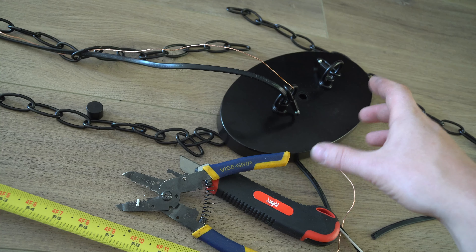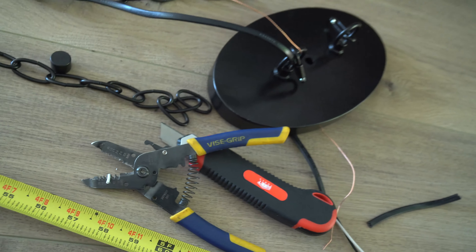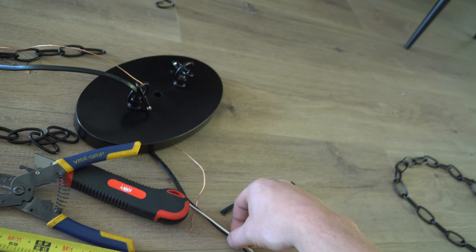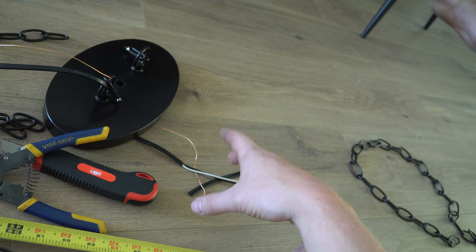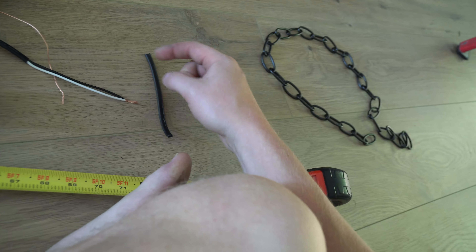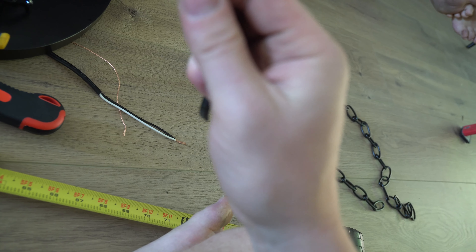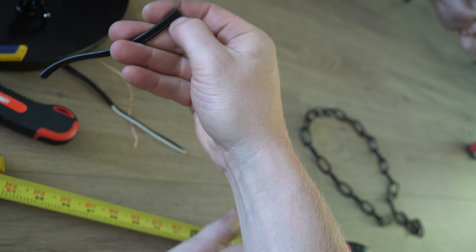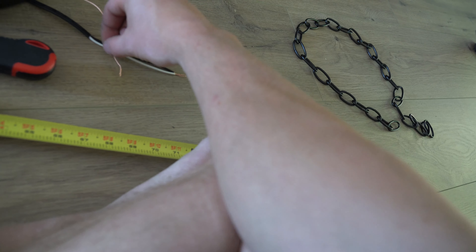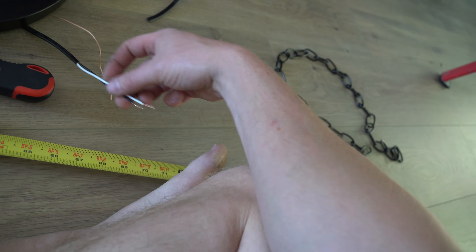Make sure you get both sides the same length. After you do that, you've bent out the piece like so, unhooked it, and left it off to the side. Do that to both sides and leave it open. Next thing you're going to do is keep pulling the excess wire to a point where you know you'll never go any lower than this, then cut that extra wire by running a knife. Don't run it around — slit it down the center. Get it started, then run an exacto down the center. You'll see the wire is split, and once it's split near the top, you can pull the two wires apart and it'll keep going to where you want it. Stop the sheath there, cut it with a knife, and strip the two ends — about that much.